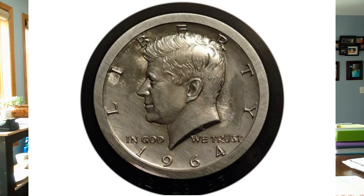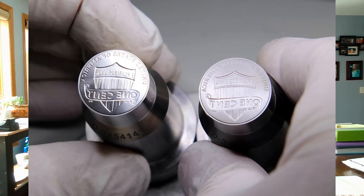The coin design starts out as a galvano. That design is transferred to a master hub. The master hub makes a master die. Hubs have a raised or positive image on their surface, while dies have an incuse or reversed image. The master die then makes working hubs, which have a raised image like a coin. Those working hubs make working dies with an incuse image, and that is what produces your coins.